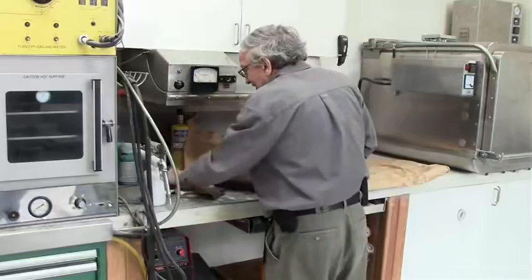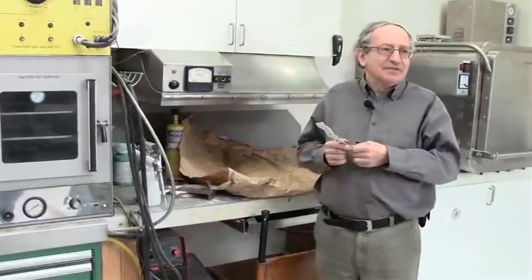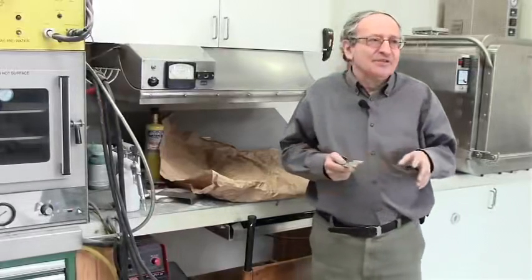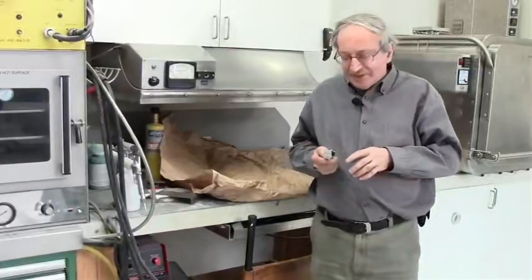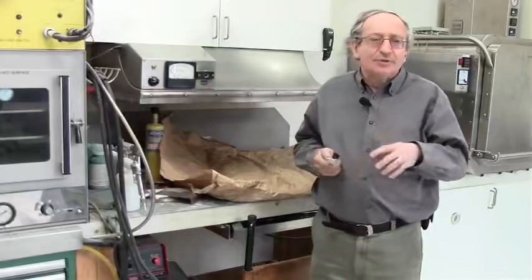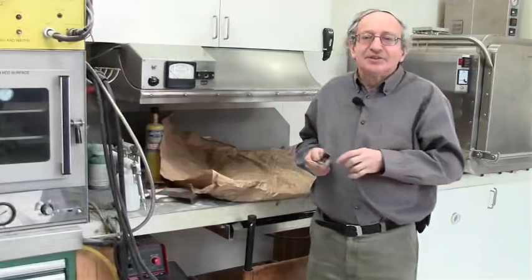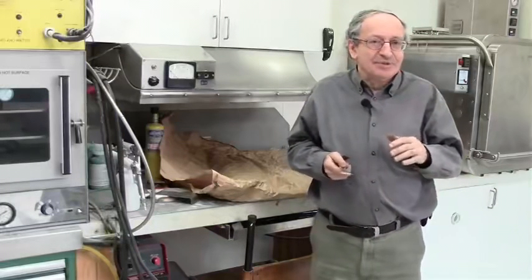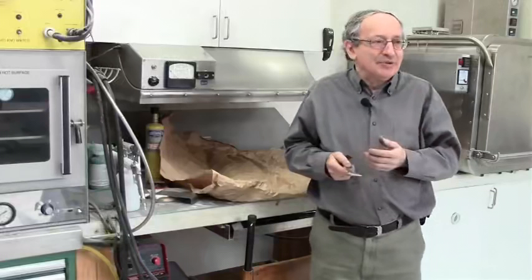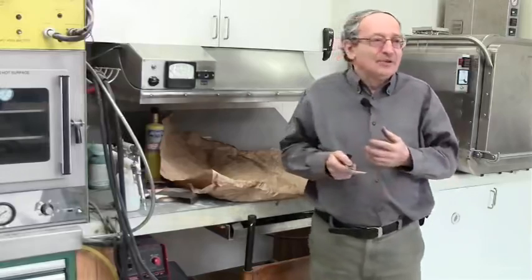So the classical way which they talk about in books for preparing a surface for painting is completely useless, because all the books say clean it with a solvent or rub it with sandpaper, and the reason why it's useless is if you clean something with a solvent, no matter how much you wash it with a solvent, you're just diluting the hydrocarbons or the oils. So at the end, there is always a monolayer left, because a monolayer is one molecular layer of hydrocarbons, and this is enough to prevent a chemical bond. And if the surface is very smooth and there is no chemical bond, the paint will not hold.